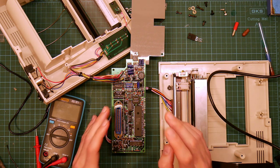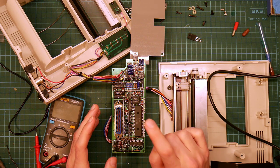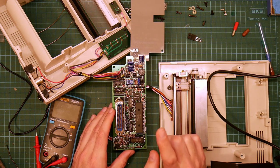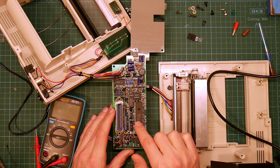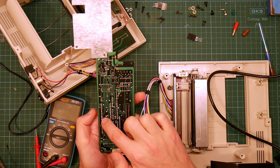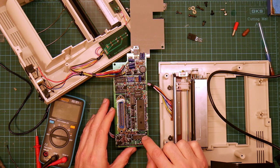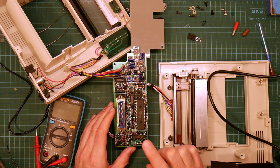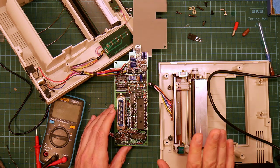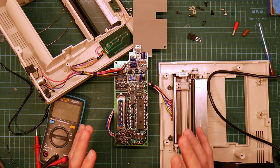What I'm going to do is power the thing up, make it do things, and then watch the waveforms produced and driven to the stepper motors. The way this works is the processor here generates the signals via its GPIO pins, which get routed to this chip — which is a transistor array used for driving stepper motors. The outputs then go to the stepper motors. Hopefully I should be able to see something interesting using the oscilloscope.